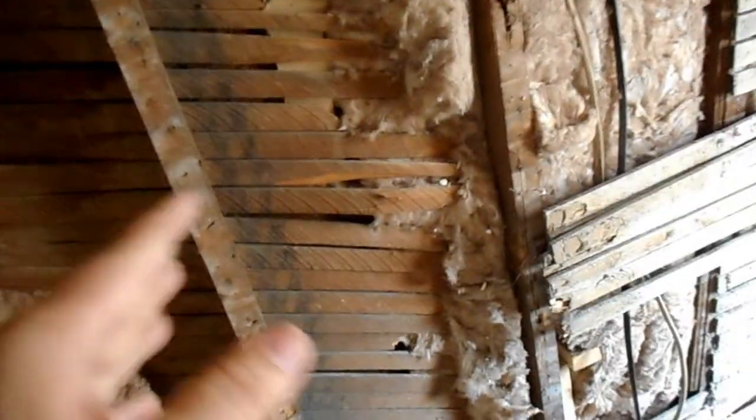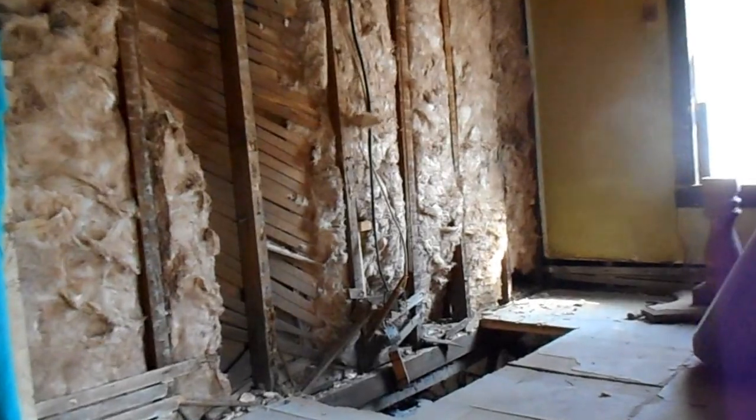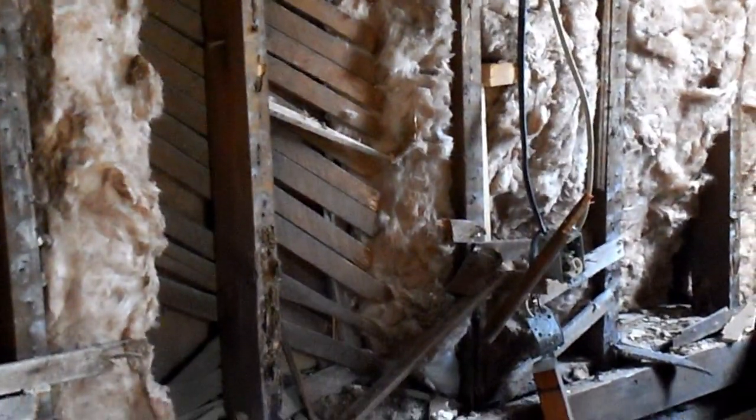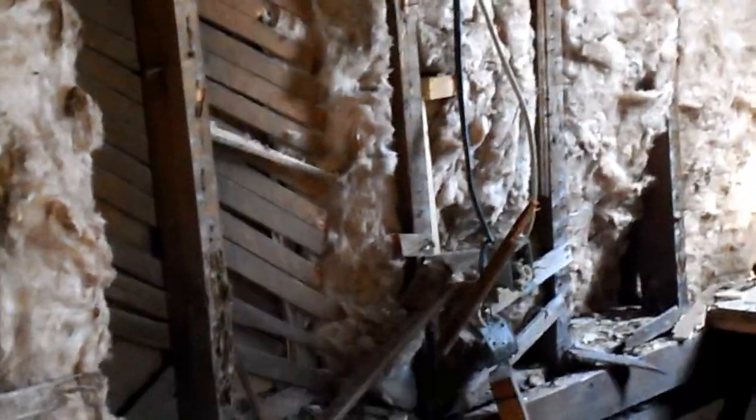So this is what we're dealing with. Chris finally showed up from his channel. I've been pulling the boards off — this is only a halfway video and we'll show when the rest of the wall is pulled off. Alright folks, there it is — the wall torn out. That's the insulation on this side of the wall. All the studs are good really except for two; the rest are actually solid. We didn't know that until we were able to get the wall out.